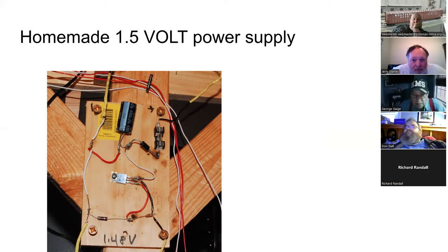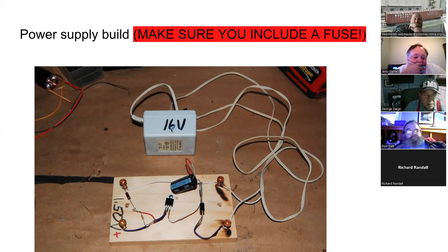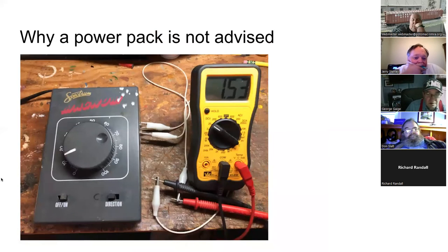So it's really, really simple, and it's voltage dependent. You're hooking up some kind of wall wart. It can be from 5 volts to 20 volts. You measure that with your voltmeter, but it's polarity dependent, right? You put it in one way, you'll get 1.5 volts out. You switch these wires, you'll get nothing out. Sorry, my mouse is so screwy.